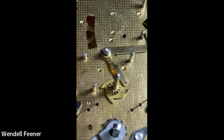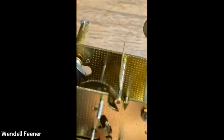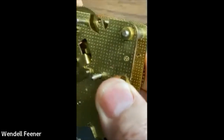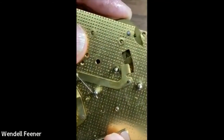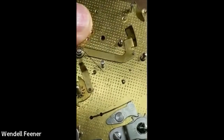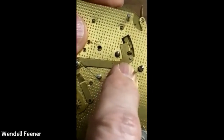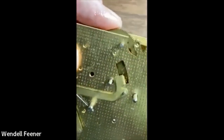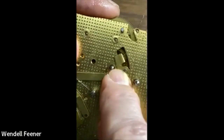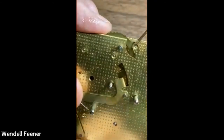Any questions on that so far? We'll attempt to stick this back together and set it up. First, I'll show what these cams look like. This is the locking cam — you see the pin and it's flat-sided because it's approaching. When it's coming up, that flat side stops on that. Then if the other piece falls down, the two of them can catch. You've got to make sure when sliding it on that you leave enough room for the levers to fall in behind. That's the stopping cam. So the first thing we're going to do is put this piece back in, because we need to set up the locking cam position first.